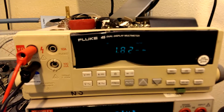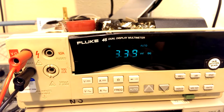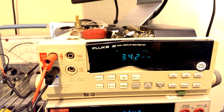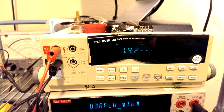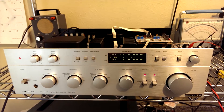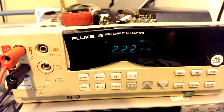Turn off the light here. That's our DC offset — it never goes above 4 millivolts or below 4 millivolts on either channel. That's pretty good; like I said, anything 15 millivolts and under is really good. But this is actually phenomenal for another reason: this is a direct-coupled amplifier, and that kind of offset performance from direct-coupled is amazing.